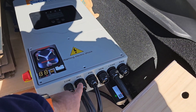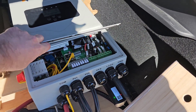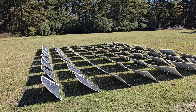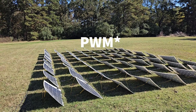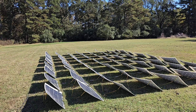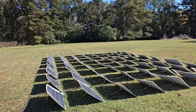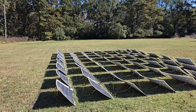It's got two charge controllers, PV1 and PV2. They're both MPPT charge controllers, which stands for maximum power point tracker. What that does is it tracks the optimal voltage and current level for each string to get the most power, as opposed to a PWM — pulse width modulated — which essentially is turning it on and off really quickly at a high frequency to match battery voltage and charge. Those are not very efficient; there's a lot of energy just lost. I've seen them run about 70%, whereas an MPPT I've seen actually exceed the rated power of the panel — so very efficient and the best way to go.